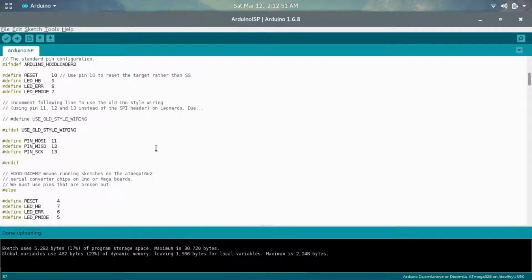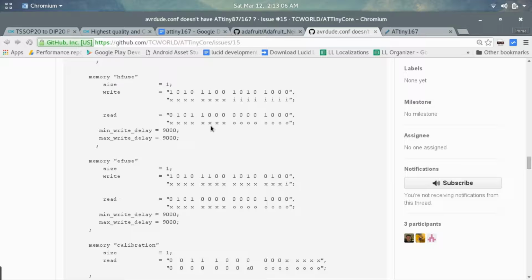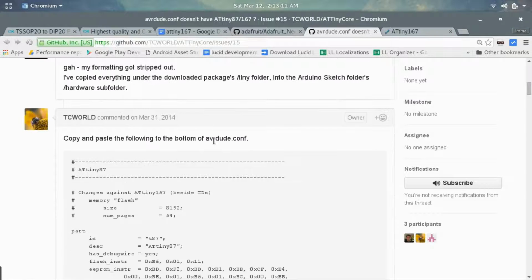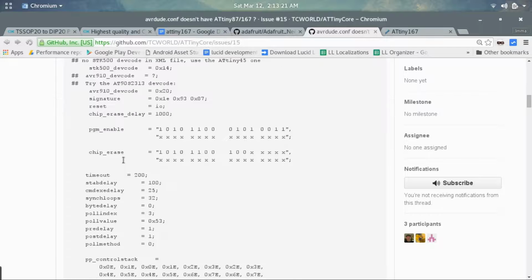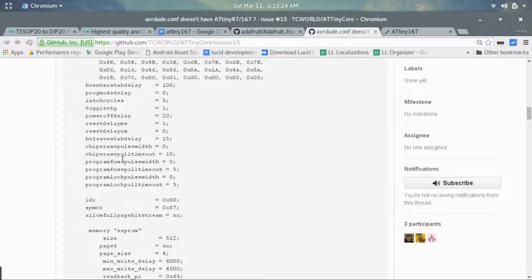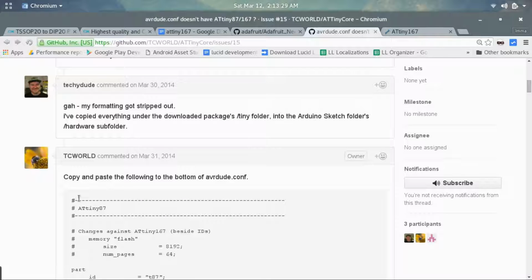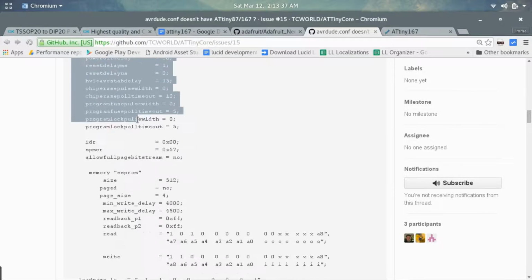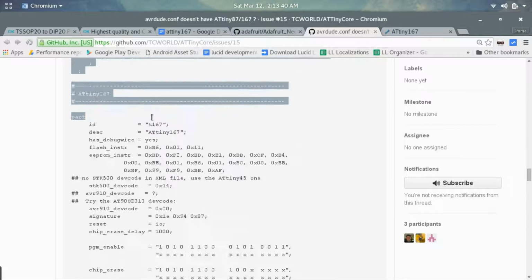Now, to avoid this, you actually do need to burn a different bootloader or set the fuses. In order to do this, we need to add compatibility for the 167 into the avrdude config file. So we need to add support for avrdude. If you don't know what avrdude is, it's a program that allows you to do various things on the AVR chips. And what we need to do is go to this link, and I will leave this in the description as well. What you want to do is just copy this part of his comment.